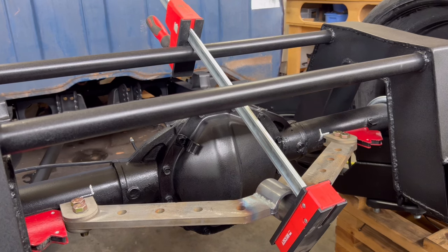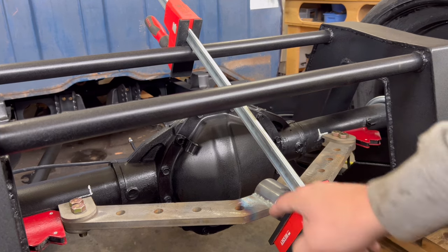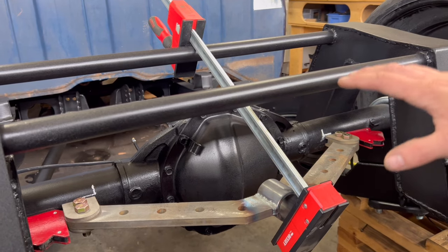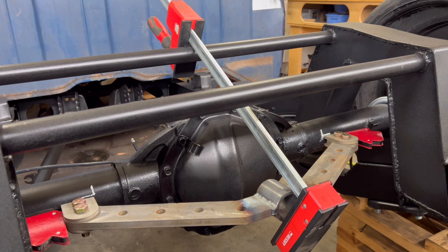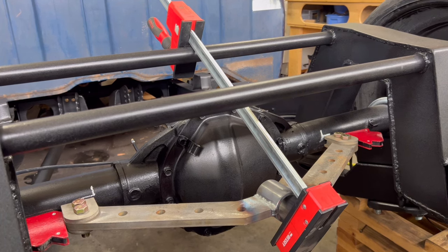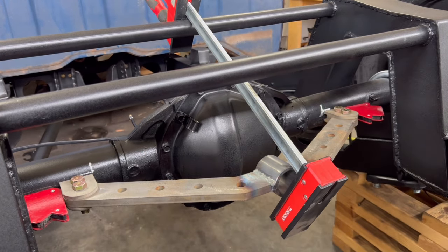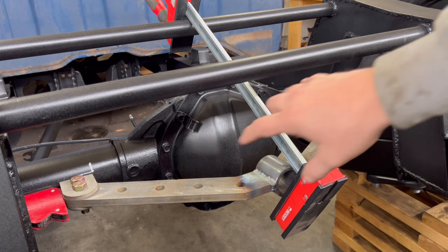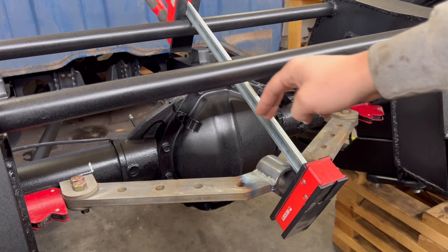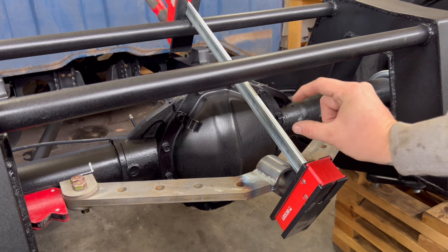I've got this rigged up a little bit to hold it — using a long clamp at an angle and two magnets holding the side end. It's barely in there, but if I can get the top tacked in it'll work. Since I don't have an extra set of hands, I'm going to try to get it tacked in just how we have it. I'll put a level on it to make sure everything is level — the angle looks really good from the side, and the top bracket's going to be right here, level.